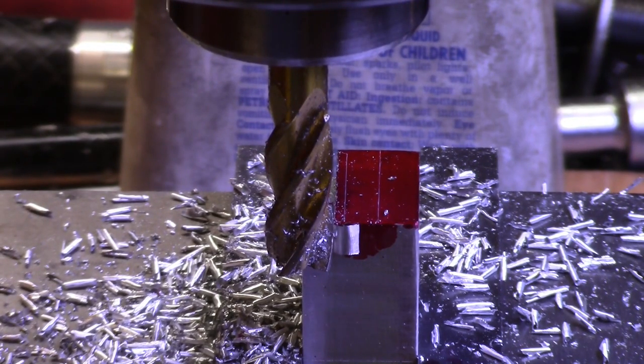Okay, so I've measured a side or two, and from the width of the slot they're in and such, looks like about 200 thousandths. Should be about right. So this thing's 3/4 of an inch thick, so I'm going to cut 275 thousandths off each side. And I think it was Mr. Pete that said you need to have a sanity check. That's what these two little marks here are. That's measured over. If I get past those, I've cut it too thin. So that and the DRO together, I should be able to get right dead on 200 thousandths, and it'll be 200 thousandths deep. So I've got a little thing sticking up that's going to be 200 thousandths tall and 200 thousandths thick. So no use me boring you with cutting it, so just hang loose.